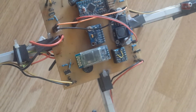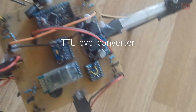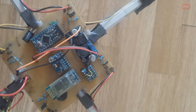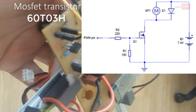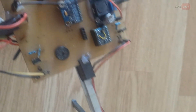The Bluetooth module is the HC-06. Next is a TTL level controller. After that is a step-down converter for powering all the devices on the board — it steps down from 7.2V to 5V, since all these components run on 5V. There are also MOSFET transistors, and under the Bluetooth module is a buzzer for a low battery alarm.